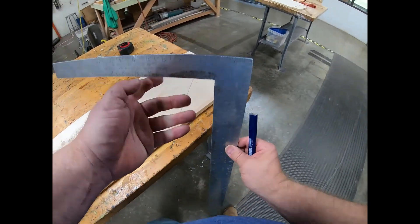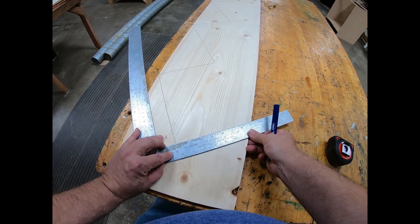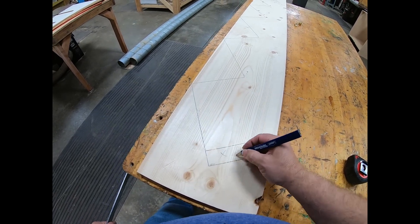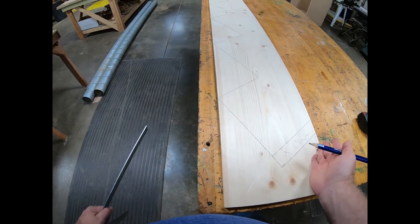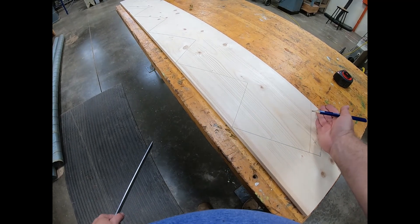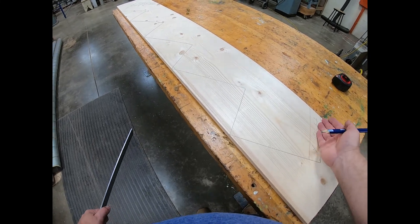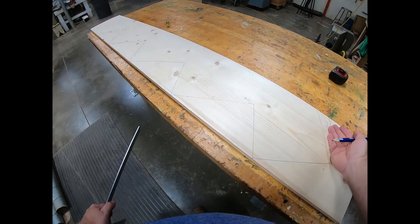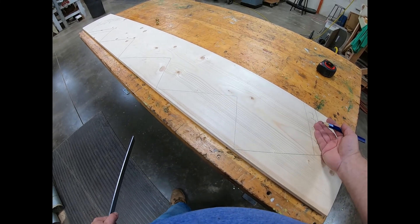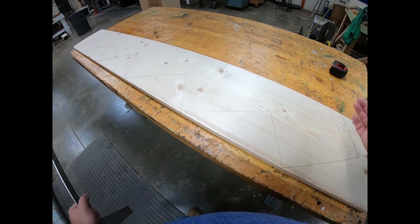Up at the top, I personally like to tie my stringers together, so I'm going to subtract off from the back of this an inch and a half and cut that off. Then I'm going to nail a two-by-six or two-by-eight to this end at the top, so when I attach to the floor above I just have to lift all three of these up together and put them in place and nail them down. It's a lot easier to attach them when they're set up as a set than individually.